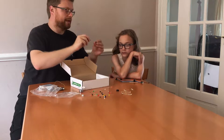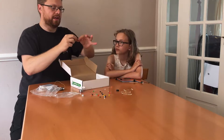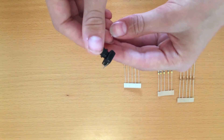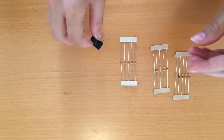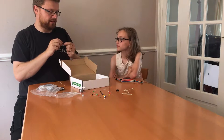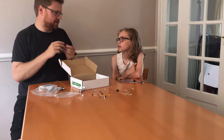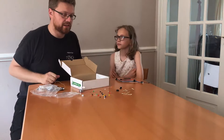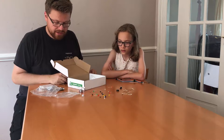This is like a little twisty bit and it clips in here. What it is, is like a resistor, but you can vary how much resistance it is — so it's a variable resistor. It can be used for things like volume control, or where you've got something that changes — like frequency — as you turn the resistance. So you can use it for changing the pitch of music.